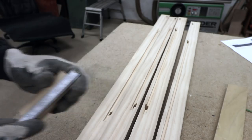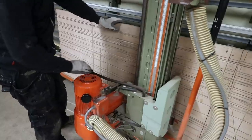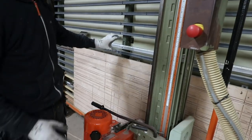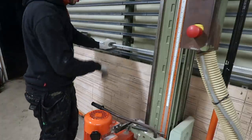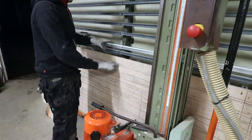So you want 106mm. Okay, so when I'm cutting small panels on the panel saw, you'll find that if you've got a machine like this, as you get smaller in your panel widths and sizes, they fall between the slats. So as you plunge the saw in and the guard hits the material, it tends to dip it into the saw bed and you don't get a square cut.